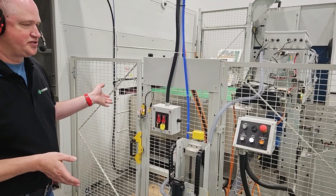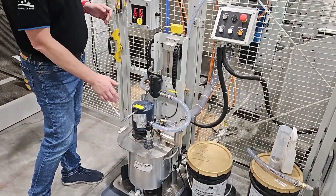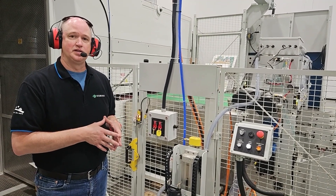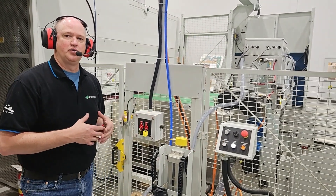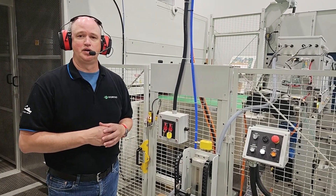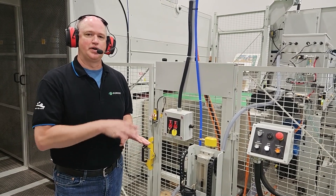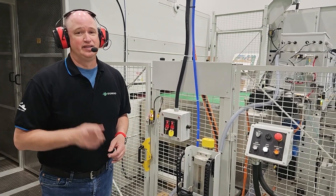Here on the back is the coder's pump — the pump and reservoir for the coder. During operation, you simply pour coating into the reservoir and turn on the pumps. It's literally that easy. We've also built in an auto clean, which means when you're done with the system, once you've reclaimed the coating, you push a button, start auto clean, and the machine will automatically go through a series of washes to flush out any residual coating and get the machine into a parked position. The other nice thing is the auto clean can be done while the machine is printing another job. So once you're done with a job that needs coating and your next job does not, you can start your wash up on the coder while you move on to your next job, saving time and being more productive.